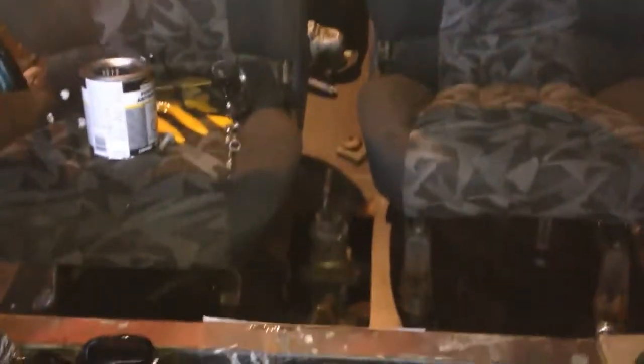They're a little bit low to the ground, but I want the center of gravity to be low since it's spring over. The leaf spring is over top of the rear end, so it sits up pretty tall. I don't want it to be tippy or anything. Honestly, it's pretty wide, and I think it's wide and low, but I just want to keep the center of gravity down, so I'm not going to bother spacing the seats up completely. I used 1-inch spacers on the inside rails because they need them there to be level. So they're level now. This one is slid back, so they're in different positions right now, but they fit pretty good.